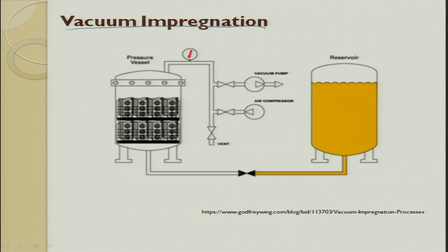In vacuum impregnation, for mass-scale production, you have a pressure vessel where the product is kept and a resin reservoir. We are talking about meter-long parts or bulk production — not just a tumbler of resin. Small components are all arranged and there is a reservoir through which resin flows. You mix the ingredients in the reservoir, coat the components with releasing agent, and use an air compressor. A vacuum is used for sucking, the matrix flows through, and excess is collected and removed.